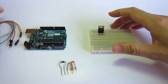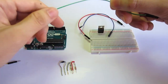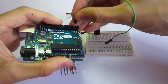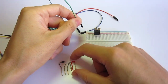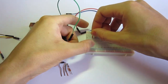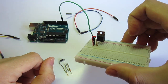To connect to the gate, first we are going to use the red cable for the VCC, the blue for the ground, and the green for the digital pin on the Arduino. In the gate we are connecting the digital pin using the green cable, connecting to pin number 3 on the Arduino. For connecting to the gate on the transistor, we are going to need a resistor of 2.2 kilo ohms, which we connect to the first pin of the transistor, and then we connect to the green cable.